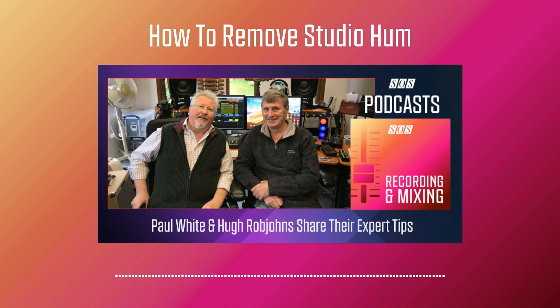We've spoken about ground loop problems, but there are also groundless problems, if you like. We've come across this in laptop-based studios where absolutely nothing is grounded. I wrote an article about this, and you see on the forum people saying 'I think I've got a grounding problem' — they're almost always right. But it can be because you've got too many ground paths, which is the ground loop issue, or it can be that you don't have enough, which is the groundless problem with a laptop system.